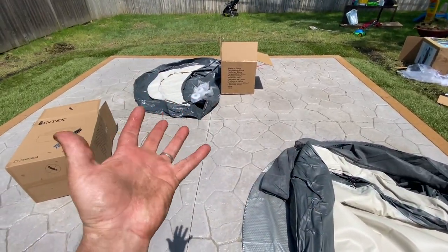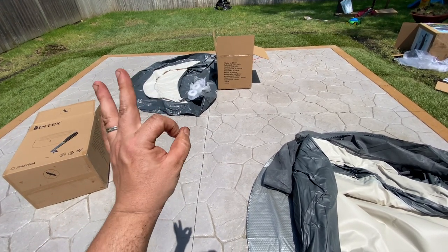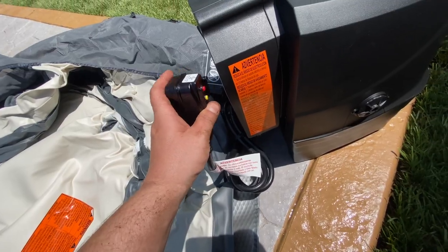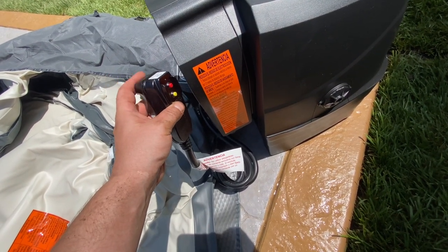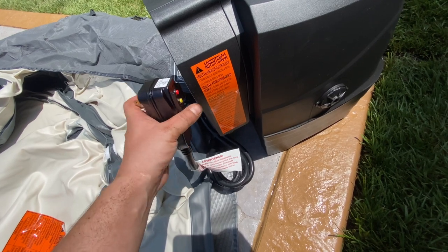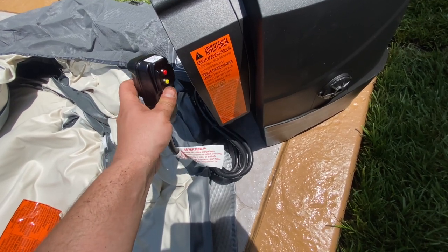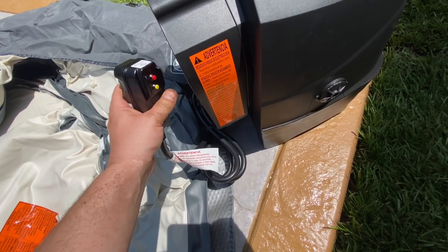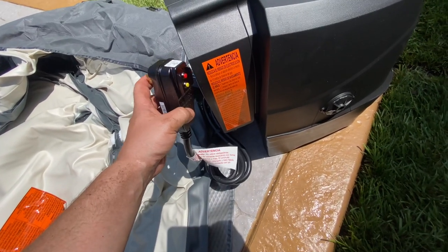I did a little engineering on paper, ran some numbers — it'll fit in here, I hope, if my math is right. So these are 120-volt GFI plugs. They say don't use extension cords, but seriously, if you've got it in your yard, who's got a power outlet close to there? So what I did was I got a 10-gauge extension cord to go from the side of the house over here. There is a GFI outlet on the outside of my house, so this could trip. I have a new GFI outlet on the side of the house with its own breaker downstairs in the basement. This should be sufficient for both the pool and the hot tub, especially with that 10-gauge extension cord.